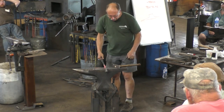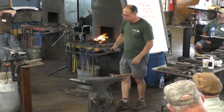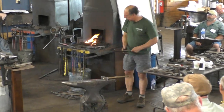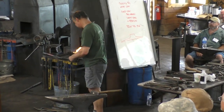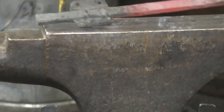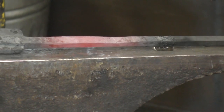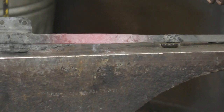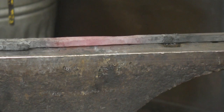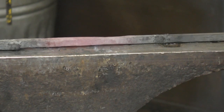So I would say only one thing that's really useful in planning this weld around the bracket is that you do not want that weld to be located right where you're going to make the corner. If there's a test of the weld, that will be it.